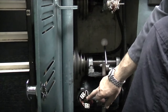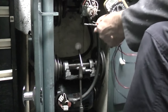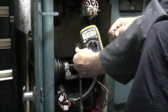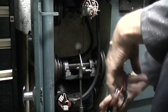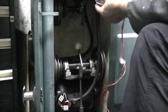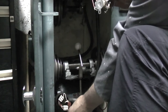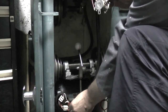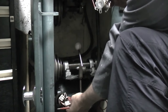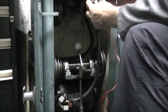You can see the connector block down here, and this is the switch here at the top. When I join the two wires together on the test equipment, it'll go to zero. When the wires are open, it goes to one. It just tells me if the wire's connected. Select a pink wire. This is number 5 terminal, and I will test whether it goes to the pink wire. Yes. So number 5 pink wire goes directly to the pink wire where I've marked up as the red coil,